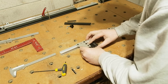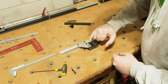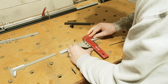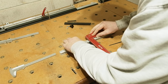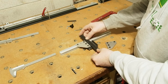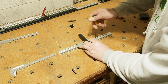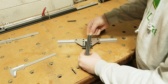I roughly centre the 2060 perpendicular to the 2020, then turn all the drop-in T-nuts on the plate so they'll align to the slots, then drop the plate in place roughly centred along one of the spines. I'll use a square reference from the 2020 to keep things true as I tighten down. It's important the pin rides straight up and down — if it's not square to the bench top it could throw your guide rail out of square at different heights. Then I can place the pin next to the first plate and fix the second, friction-tight to the pin to eliminate side-to-side movement but loose enough to allow it to freely move up and down.